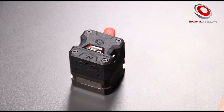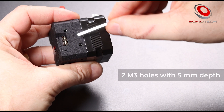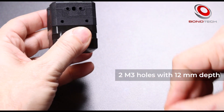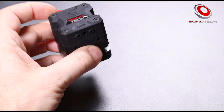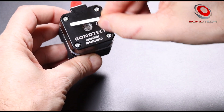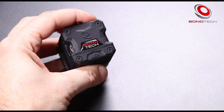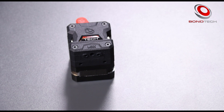The LGX has many mounting hole patterns. On each side there are two M3 holes with 5 mm depth. On the bottom there are two M3 holes with 12 mm depth. On the back there are the usual four holes on the stepper motor. On the front we have a similar mounting pattern with four points. In some applications, using the front holes is the best solution to mount the LGX on a carriage.